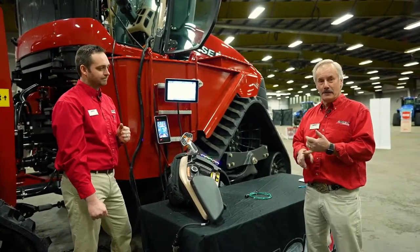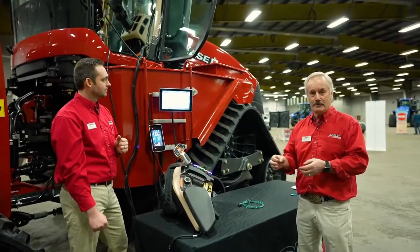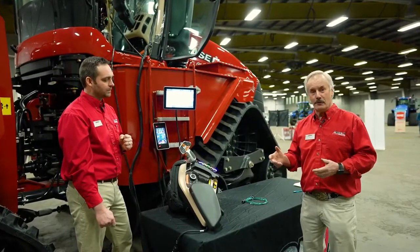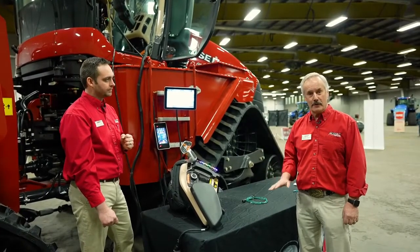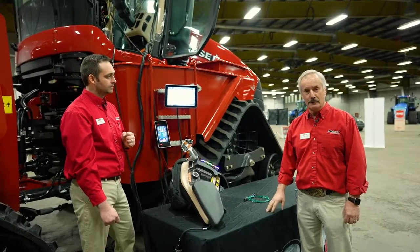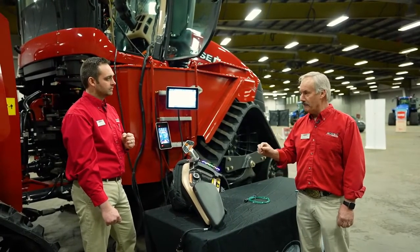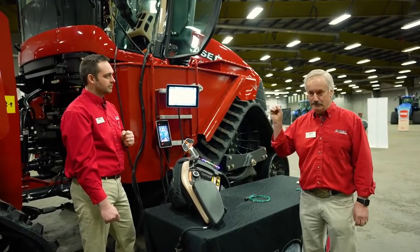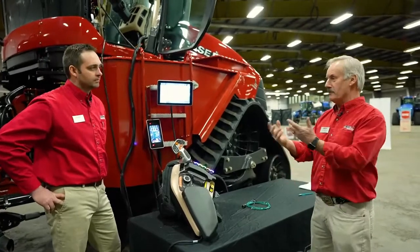That's right. Every air seeder on a lift cylinder, or any implement you put behind, if they have a cylinder on it, the cylinder has an orifice. The orifice is only so big, and I have no idea what the size of the orifice is. So what I'm going to do is I'm just going to lift it, and I'm going to count how much time it takes to go from lower to raise, and back from raised position down to lower. And as soon as I see that the implement is no longer speeding up, then I back off on the flow control, just a hair. Back off on the flow. And then that way it will basically verify that that orifice that's back there is only going to take 6 gallons per minute. That's the easiest way that I know how to do it.